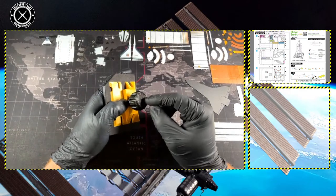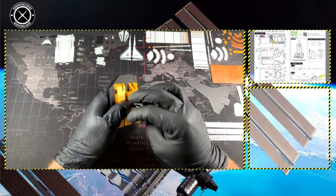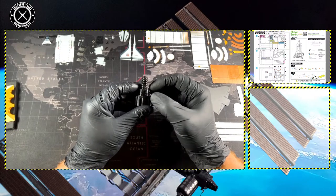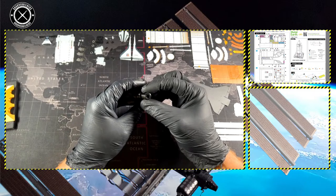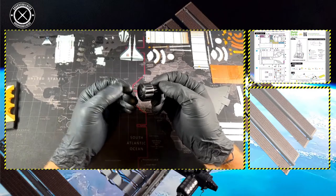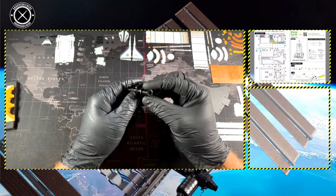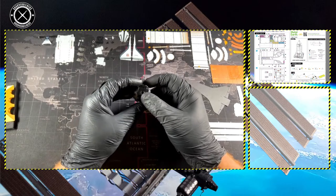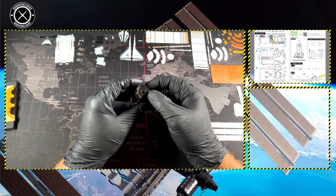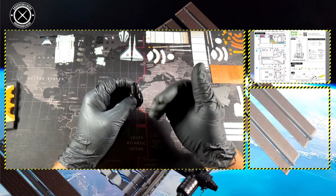I've actually improved these. I've only had one complaint so far about the bolt breaking, and that's because the bolt is under tension. If we look closely here, you can see this is where the tension comes up on everything, and I knew there might be a problem with that, so I was trying to pay as close attention to it as possible. That's why I said if you suffer any issues with these, please just let me know. I will gladly send you new parts, no issue. What I did was I found a YouTube video talking about how to make your parts stronger. I forget the name of the gentleman's channel, and maybe I'll put it in the description a little bit later. But he said that if you put a hole through the center here, it will make it stronger, because it creates a wall on the inside of the screw, and it's not just infill. So I found that this was a great solution.